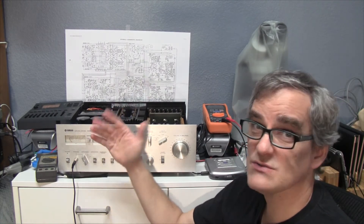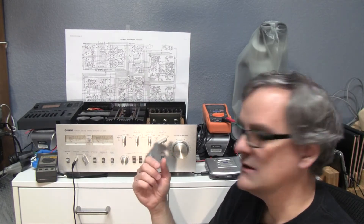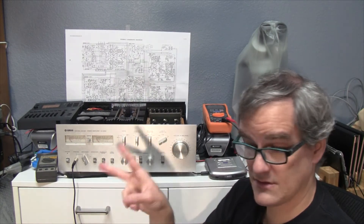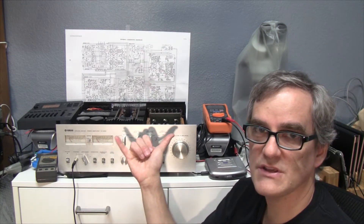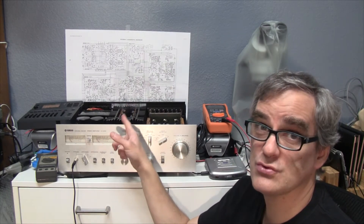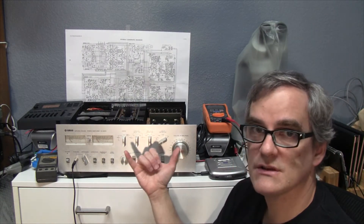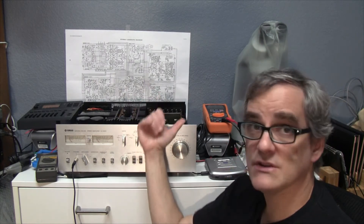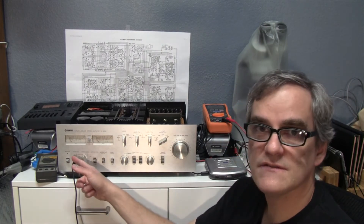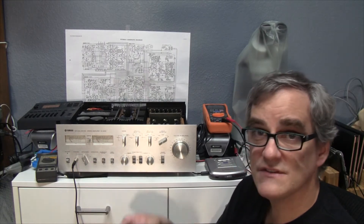Instead of using loudspeakers, which gave really no sound whatsoever, I was also a little bit afraid that if the amplifier went haywire somehow, it would throw the full power at the loudspeakers and blow them — because this amplifier is 120 watts, extremely powerful. So I disconnected the loudspeakers so I wouldn't have any trouble with that, and decided to use the headphones instead.